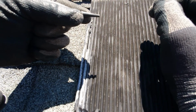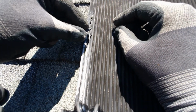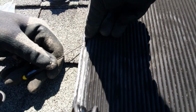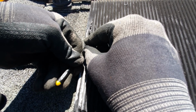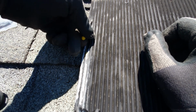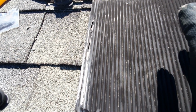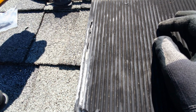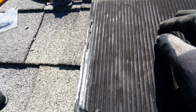You then take this little plug here, and this is what you want to cut away half of the collector, the vane there. There's a little hole in the back of the plug, and you just simply guide it as far in as you can get it, just like that. Give it a little twist so it lets go, and now that guy's somewhere up in there. Now, generally speaking, it works, and it works great. Sometimes I find those plugs will slide back, and that's where I'll put in the RTV.